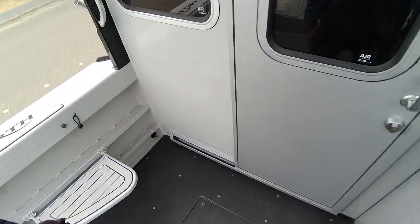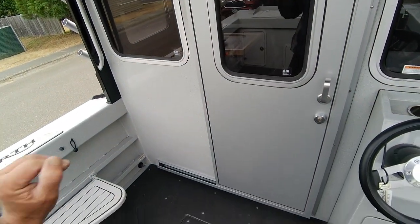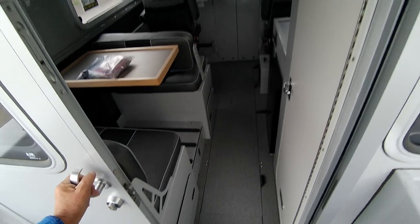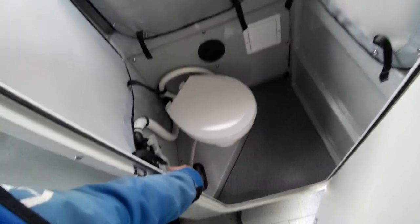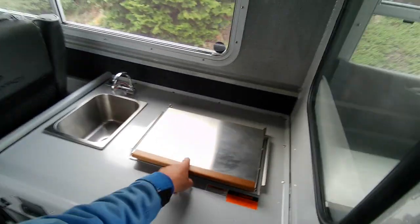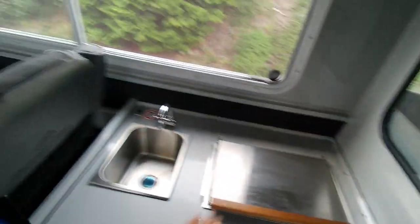And those there are drains. We put those in because say a guy parks his boat like this, then the water is going to pool up and just stay and then work its way back — so that's why we put those in there. You got bench seats, those flip. And then in here you got light, you got your pumps, pump out, your flush. They put your lever right here for your waste — you can turn this so you can suck it out, pump it out, or put it into your tank. And here's your heater.